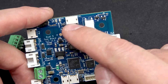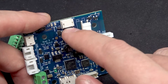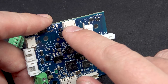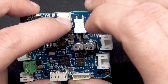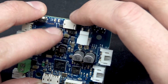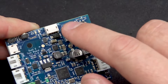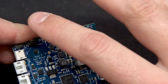I don't run this with the tool distribution board, which you can purchase separately. What they tell you to do is use an RJ11 connector which goes into your motherboard, snip off the cables, and then attach just two of them going into this. You also have to connect a 120 ohm resistor to the rightmost connectors, and what I would like to see is them adding a jumper here. That way, if you're running without the tool distribution board, you can just add a jumper and you'd be set — you just have to clamp the two cables.